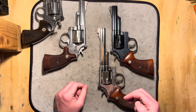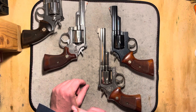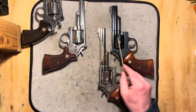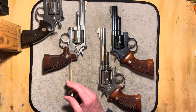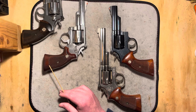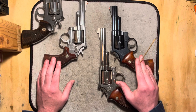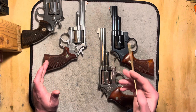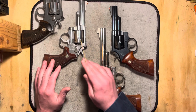It's not a big deal, particularly on these two. They trim it up so they can get a smaller cylinder, and this is a holdover from the old Model 10s where they were firing .38 Special. Really, at their onset, these were intended to mainly fire .38 Special. They are capable of firing .357 Magnum — they're capable of it — but they were never really intended to have a steady diet of .357. It's a K-frame, a .38 Special frame that they made work with .357 Magnum.